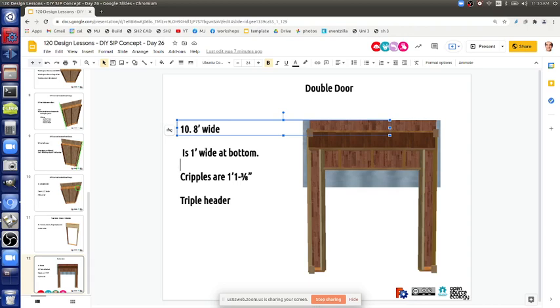you need two bits of information to do this from scratch if you know the system. One bit is that that's 1 foot. Second bit is that the cripples are such and such. Everything is constrained by the materials you're using, knowing that you're doing an 8x8, well, it's 8 this way, 9 up, and 9 is not exactly 9, it's 9 3/8 inch, because the pre-cut studs are 3 3/8 under that nominal dimension. Like a 9 footer is 3 3/8 smaller, something like that. You don't need to worry about it, you're using pre-cut studs that determine that for you.